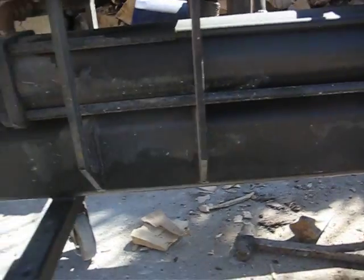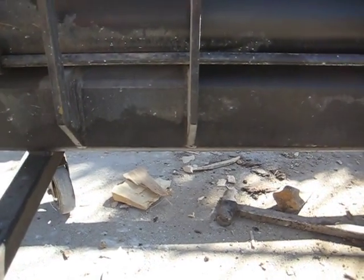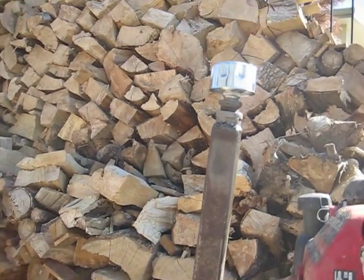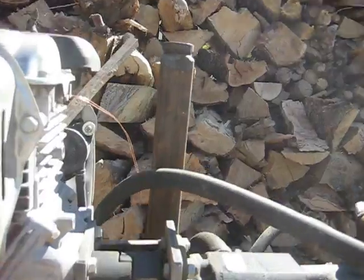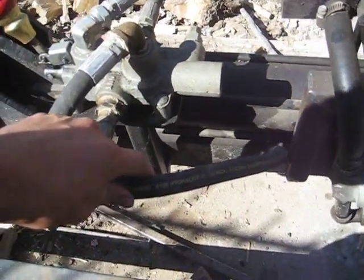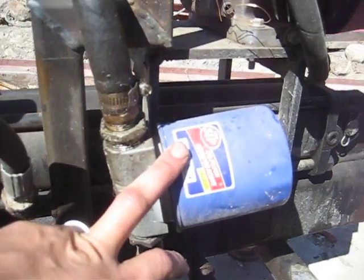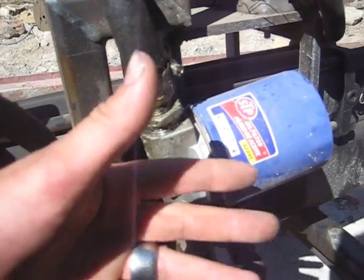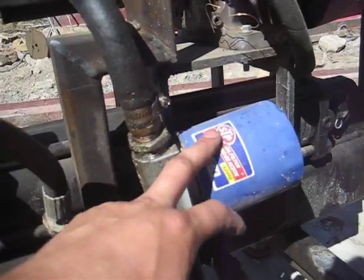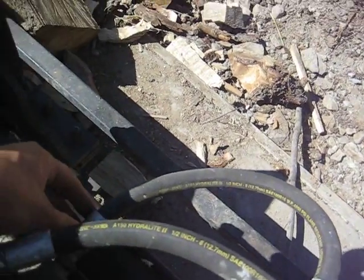What I've done here is use tube on the bottom instead of I-beam like most people do. That tube is also the reservoir for the hydraulic fluid. I have a vent cap there and a filler cap here that also connects into the return line coming out of the valve. Most people have their filter on the return line, but I thought — what's the point of that if all the fluid has already gone through your components? So I put the filter in the suction line, which comes from the bottom of the reservoir up into the pump.